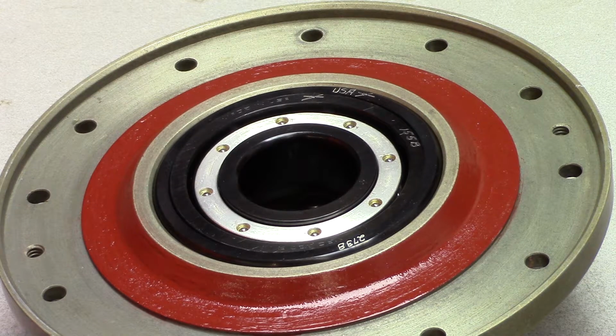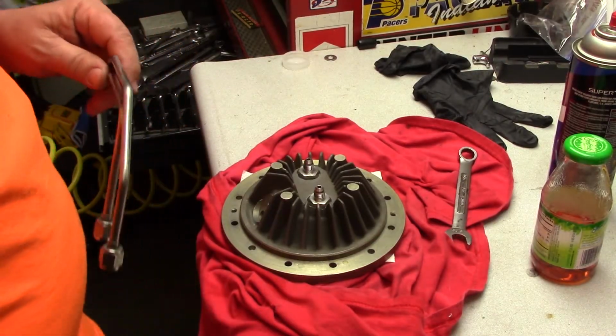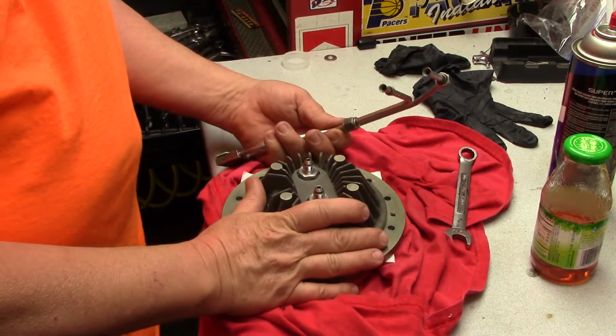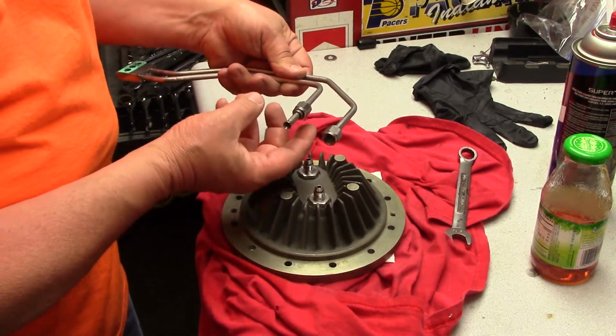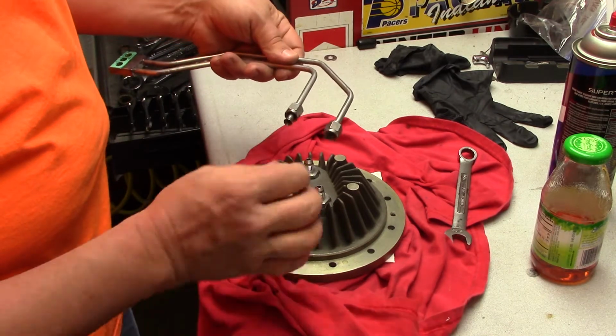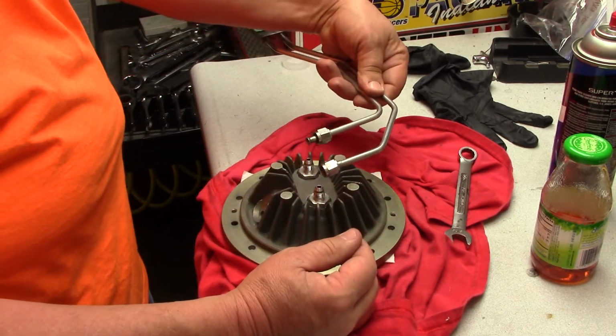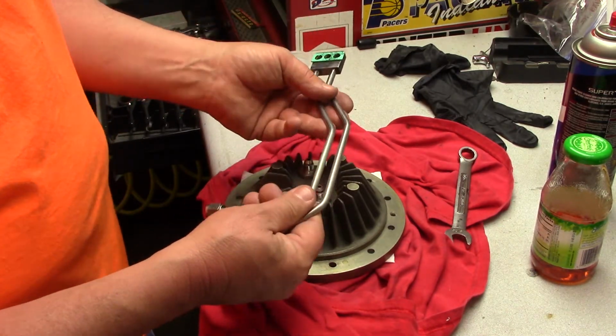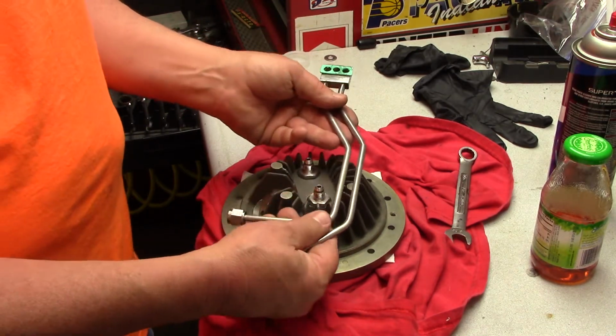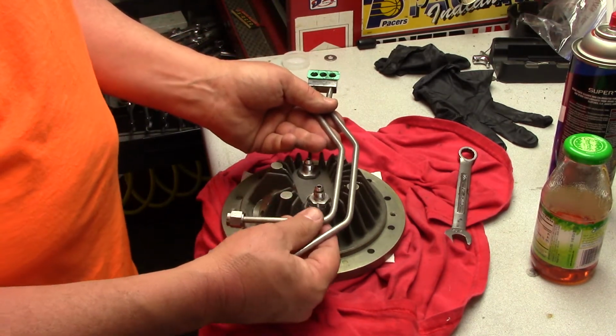Okay, now we're gonna shift gears here and move over to the exhaust nozzle housing, and let's try to put this thing in there as soon as it cools down. All right, we've got our bearing installed. The housing's cooled off now, where we can work with it. We're getting ready to connect our air and oil mist tubes to the fittings here on the back of the bearing housing. And these, as I showed you before, this set of tubes pass through one of the struts holding the bearing housing, holding the rear support.